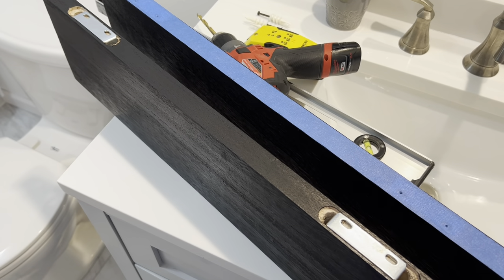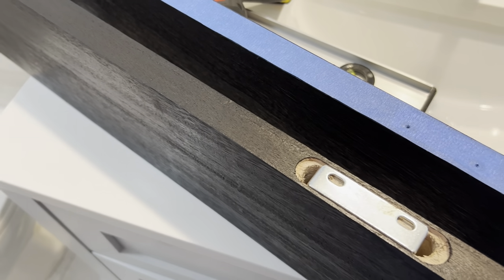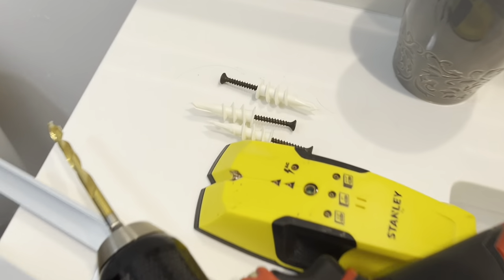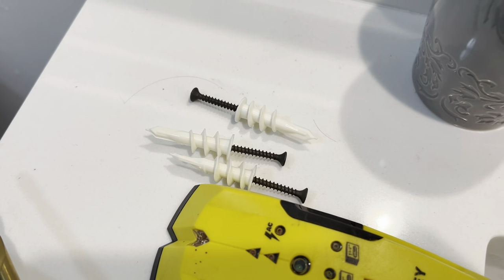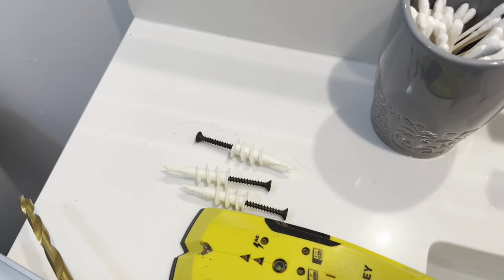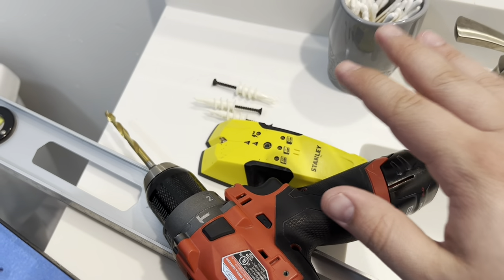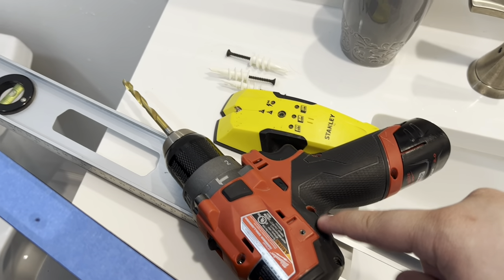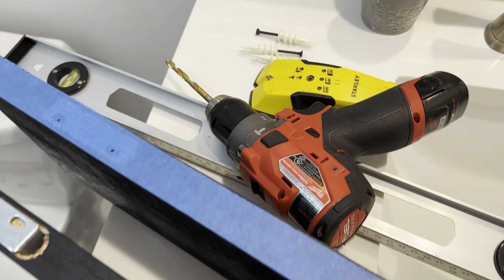So you can see we got our floating shelves in here already, which come with the brackets that we will be pulling out and screwing into the wall once we've installed our drywall anchors. Those are just for drywall, so if you are going to hit a stud you'll need some stud and drywall anchors, but these come with the kit. You also need a stud finder — if your dad's in the house, watch out, it'll go off every time. You also need your drill with a quarter-inch drill bit, a level, and a hand screwdriver.